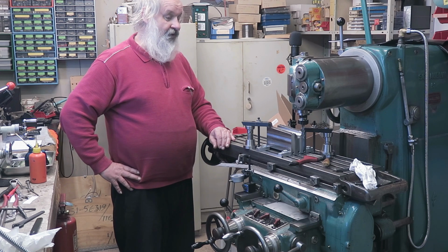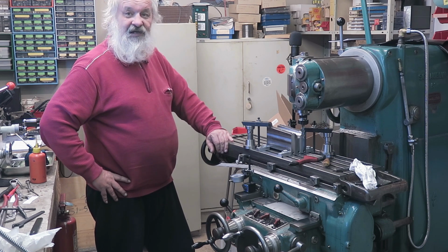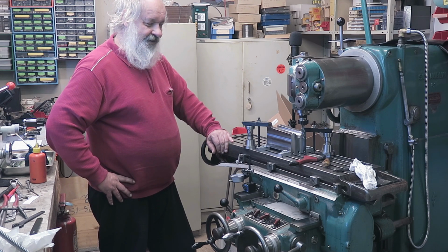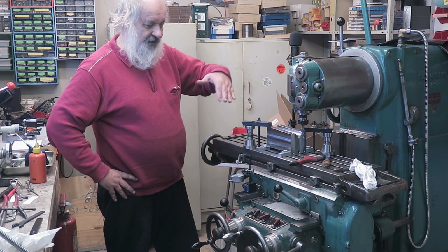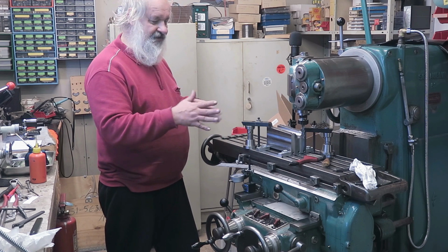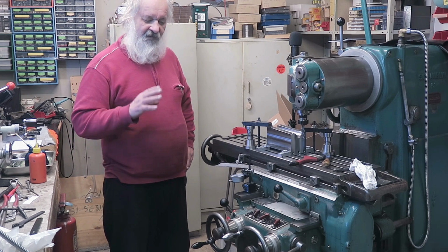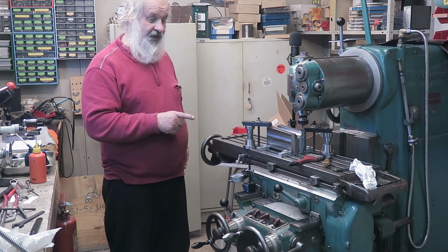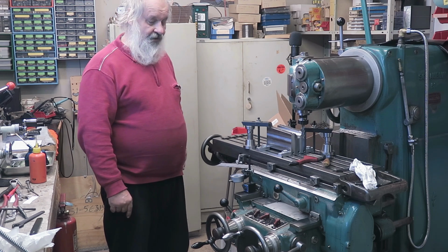Now I'm going to mill it, and it will be higher speed and lower feed and climb milling. I'm not comfortable with this mill because it has 0.4 millimeter slack, backlash in the screw. It might become a problem, but with very slow speed and feed, and the cut is only 0.5 millimeters, but it's 9 millimeters wide nevertheless. So let's mill.